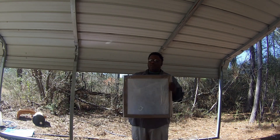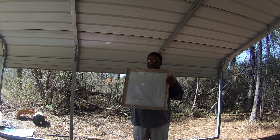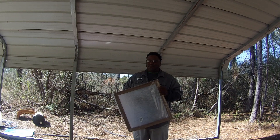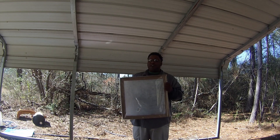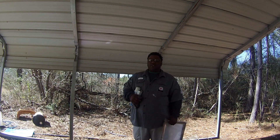One thing you can do for preventive maintenance is to change your filters regularly — once a month. Changing your filters monthly can help prevent your air conditioner compressor, a commonly forgotten part of your unit, from failing. If your filter is clogged or dirty, it builds up high head pressure in your unit, which causes components in your compressor to heat up and can lead to electrical failure.